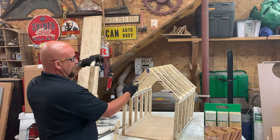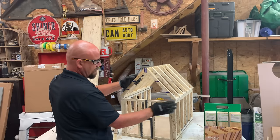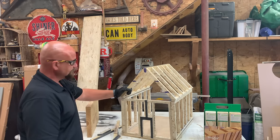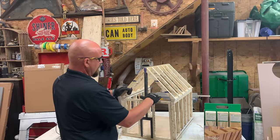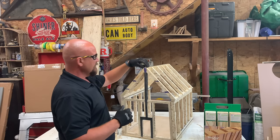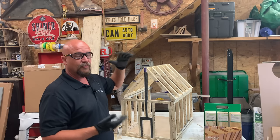Now let's look at a structural-style roof using engineered lumber beams and supportive columns designed either by your engineer or through Weyerhaeuser software such as ForteWeb or our Javelin software. We're converting from putting all of the roof weight into the walls, and instead building a ridge that could be single-ply or multi-ply LVL depending on the size needed — up to 24 inches in depth for multi-ply microlam.